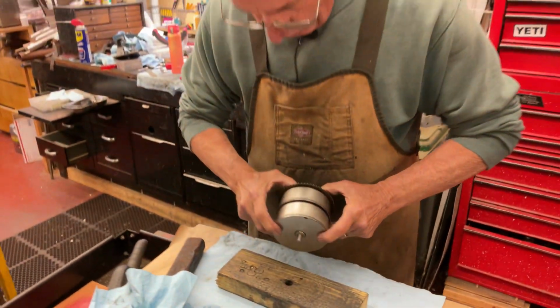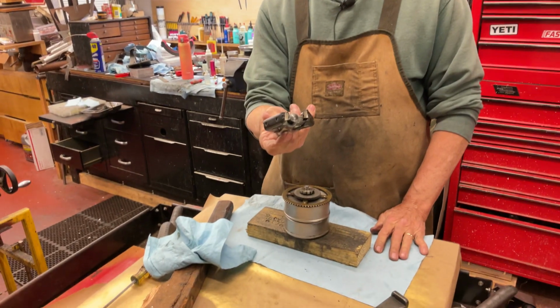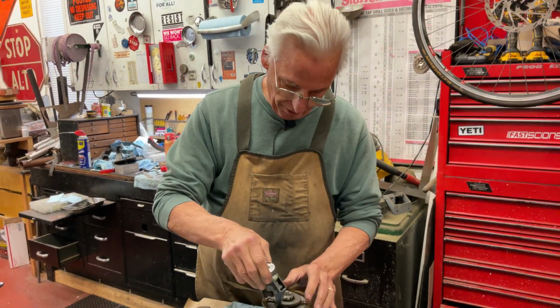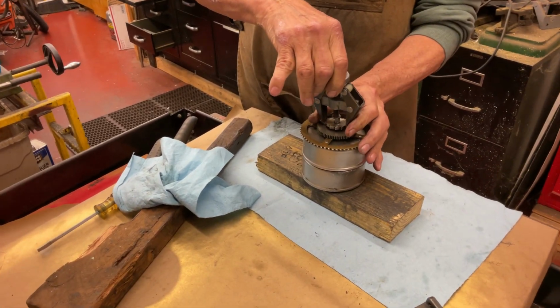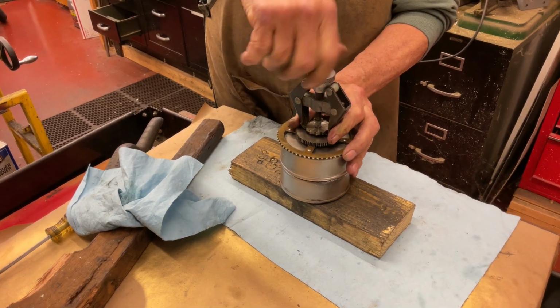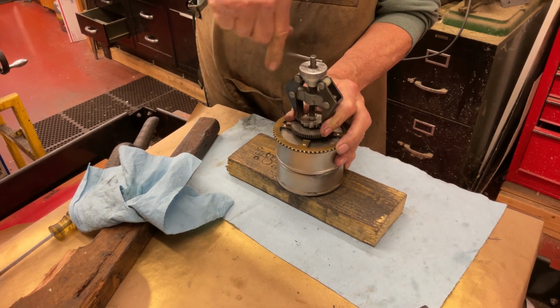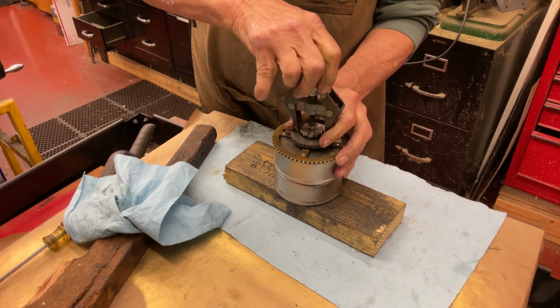What you need is a windshield wiper puller. And this is a windshield wiper puller. This is to get windshield wipers off your car. You're going to slide it in like so. Put the flat part right above the shaft. And if you're lucky, it should just pull right off, just like that. Okay, we back this off.